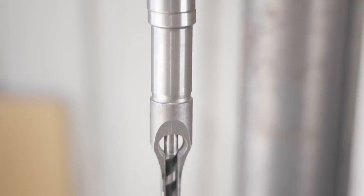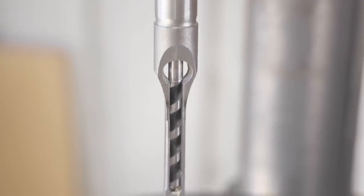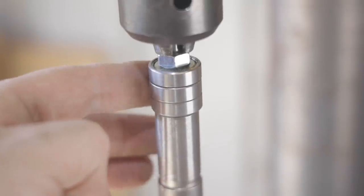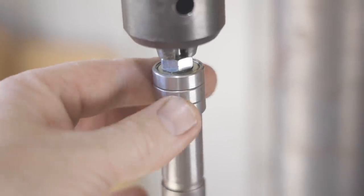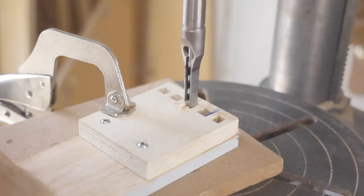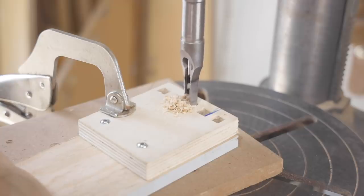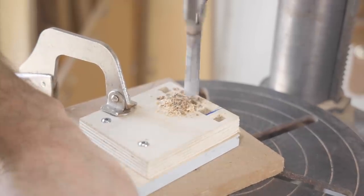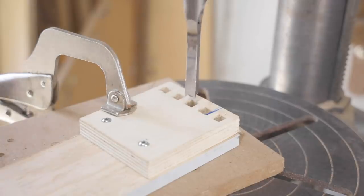This is how I made the joint that I showed at the start — don't take it too seriously yet. I put a couple of loose fitting skateboard bearings on there, then put it in the drill press with a nut tight between the bearings and the chuck. Using a guide that I roughly made, it holds the chisel and stops it turning while the drill clears most of the waste, and then the chuck pushes the nut and the bearings into the chisel so the chisel can square the hole up. Obviously this needs to be better, but it shows that the concept may work.